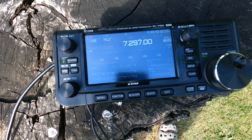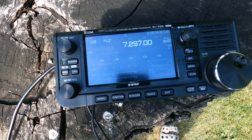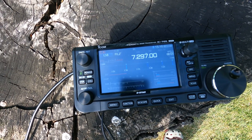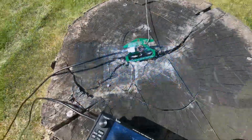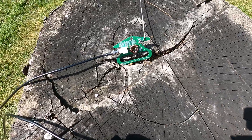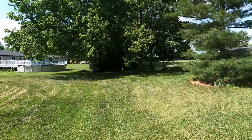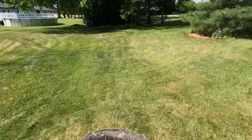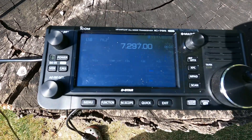So the addition of 10 more feet of coax laying on the ground acts as a counterpoise on this antenna and does make a significant difference in the SWR. I'm going to make one more change — I'm going to get that unun up off the ground and see if that makes a difference. I've taken the unun that was on the ground and put it up on this log, maybe two to two-and-a-half feet up. That puts a little more droop in the antenna line; it's not drawn taut like it was before.